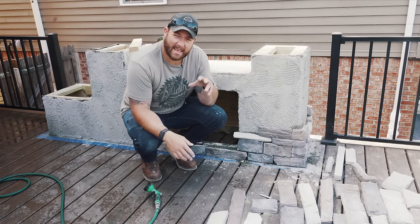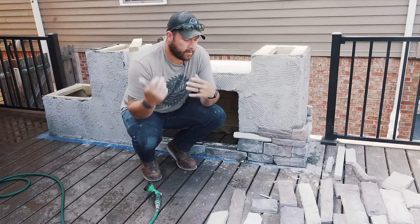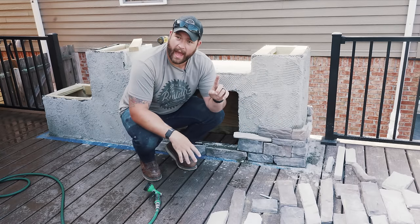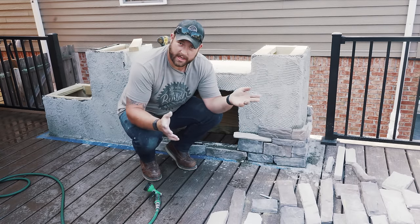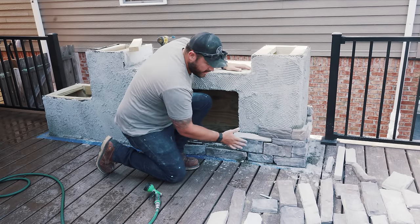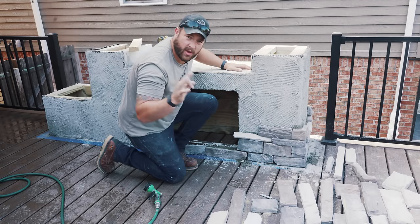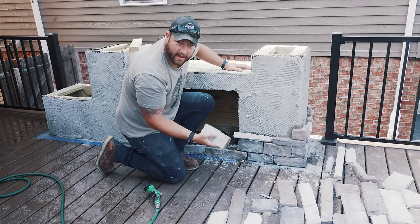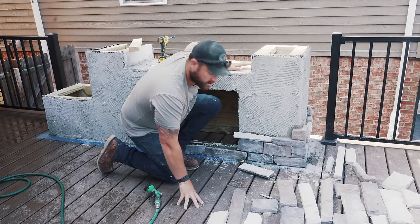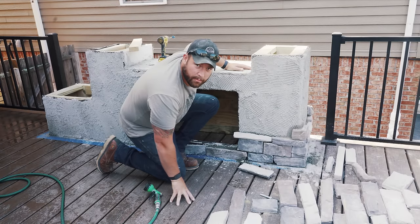By a series of fortunate events, the masonry guys came and just did a little pointing work on the brick for the window. And they were helping me out with what we're doing here. First tip they gave me: add some S-type mortar to my mix, which I did. Two, go ahead with a little bit of pre-layout — the way this is going in I'm going to have to start cutting stuff, and it's easier if I pre-lay it out. Third tip: wet the back of these just slightly to get them to stick a little better. It is going pretty smoothly, ironically — this was a couple minutes of work. I'm just going to keep plowing through this.